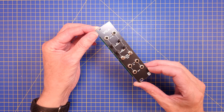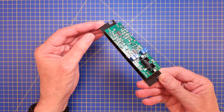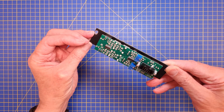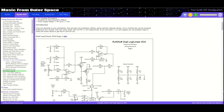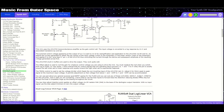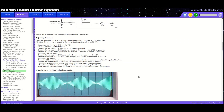Hello everyone. In this episode I will look into a really useful module, the voltage control amplifier, or VCA for short. I'm using a classic design made by Ray Wilson, the Linlog Dual VCA from the website Music from Outer Space. This implementation is based around the LM13700 OTA, so you will get two VCAs in one package.